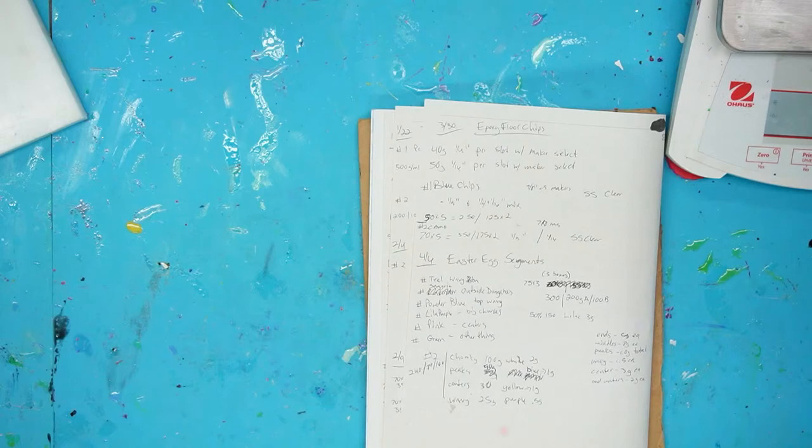I've seen a lot of questions about ovens, heat, and pencils, so let's talk about that. I don't claim to have extreme knowledge about how this all works, but I've done it a few times without bad results. Colored pencil blanks are kind of tough to turn — there's minimal resin, you're not fully encapsulating them. I'm using round ones, but I think hexagonal or octagonal pencils are a little easier to cast and turn — they seem to stick together better.